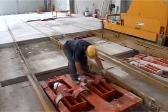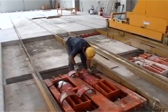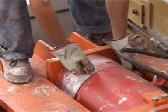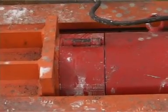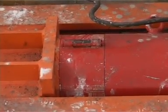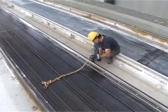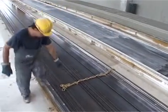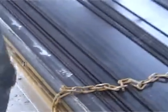The steel wire tensioning is preceded by the assembly of spacers on the detensioning cylinders, which are used to release the cable once the concrete has cured. At Nordimpianti, safety is paramount, and so before the tensioning operation is started, safety chains are positioned across the bed to give operator protection should accidental wire breakage occur.